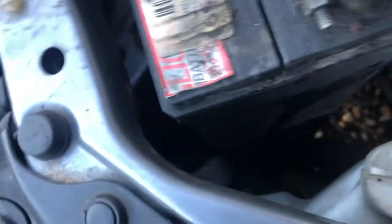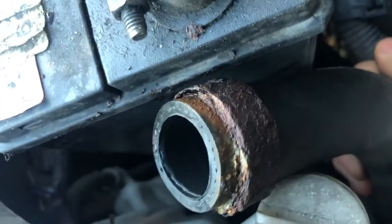So if your blower's working, usually it's maybe a water issue. I've had a quick look, and I'm surprised the engine's still running, if I'm honest. I pulled it up just to see, but the bottom hose — the Jubilee clip has snapped. So she's got no water in the engine at all.